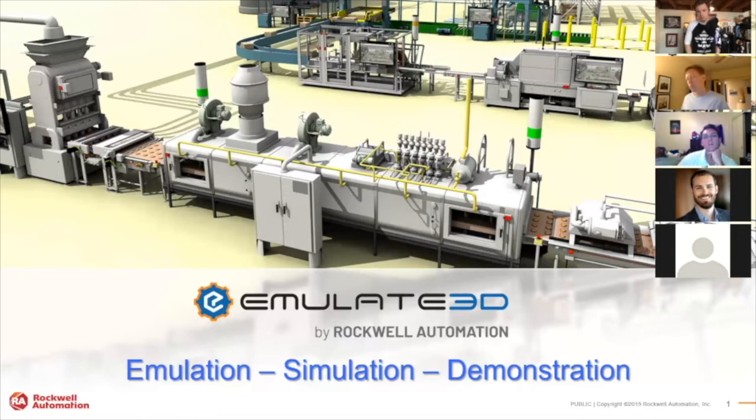So we use these terms emulation, simulation, and demonstration to talk about creating 3D models that are used for things like sales purposes when we talk about demonstration, to create 3D models that are used for things like testing throughput of a system or time in state or utilization. That would be simulation, something that's all self-contained. And then we talk about emulation, or the alternative terms would be a digital twin or virtual commissioning or controls testing, and that is creating this digital model that can be connected to external controllers in order to test the interaction of the equipment or the system and the controls.